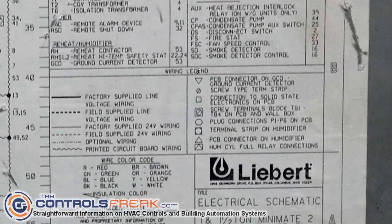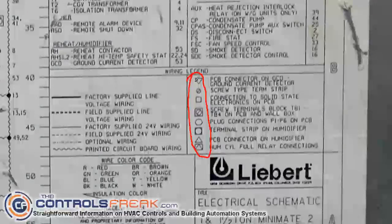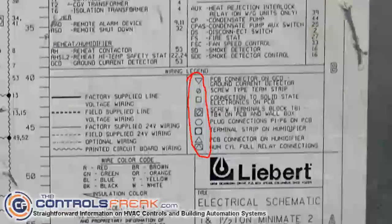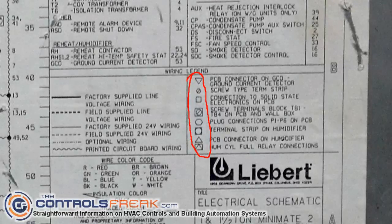The legend also shows you different shapes that you're going to see on the diagram — different shapes to represent a screw, a terminal, or maybe a particular terminal on a plug. This will help you look at what you're seeing physically. Even though you're showing it on the schematic doesn't necessarily mean it's in that position when you're looking at the actual hardware. So you definitely want to look at those shapes to know: should I be looking for a terminal with a screw, or a white plastic plug? Definitely pay attention to that, it'll help you out.